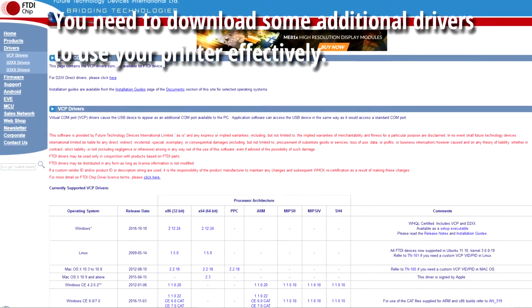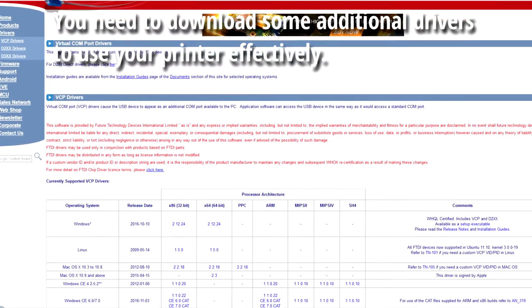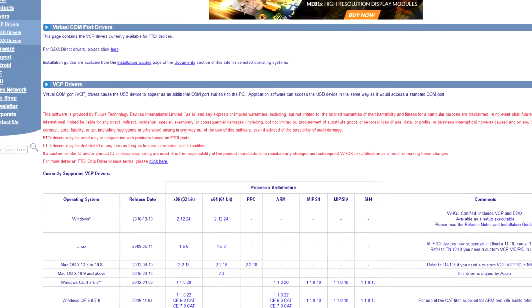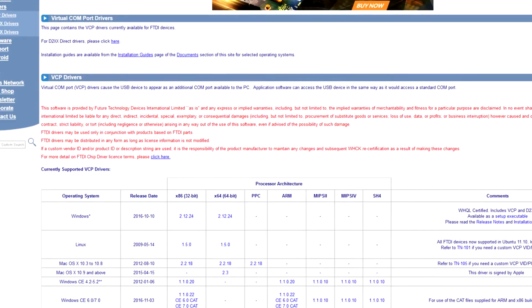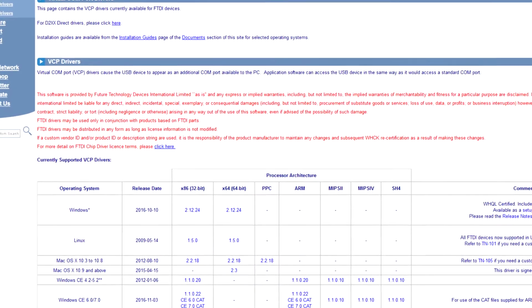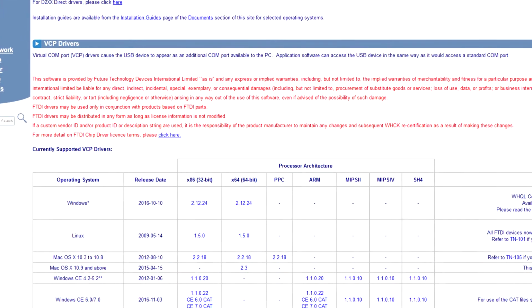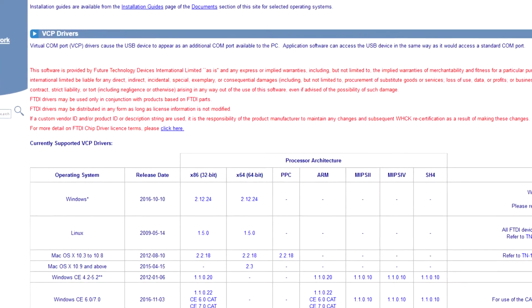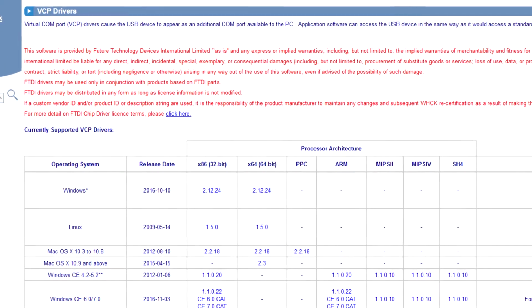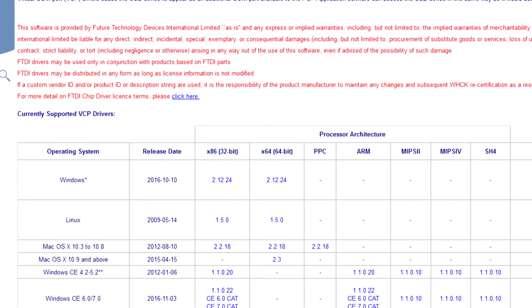Now when I plugged it in, it got recognized as something like FT-5, and my computer said it didn't have the driver for it, so I had to go to the FTDI website to find the new drivers. I googled the board, found the page for it on RepRap, and went to see how to get the firmware for it. I had to install a new virtual COM port driver. I'm linking in the description the place where you can download that. Download the executable because it's way simpler. This is something I should let you know because it was not in the directions at all. It just assumed that your computer would recognize it, and it did not do that for me. So you need to update your drivers.